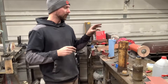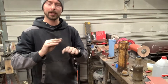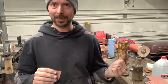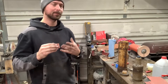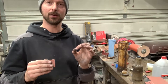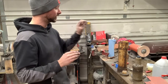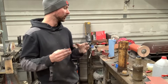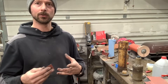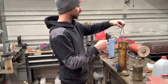It's been in for about 10 minutes — I'm going to pull it out and show you what it looks like. Then I'm going to do a really light polish with 1,200 grit sandpaper over the whole blade, do a quick rinse with distilled water, and then it goes back in the etch for another 10 minutes. What this does is polish and show those layers better. When you bring it up to 2,000 doing this and then do a coffee etch, compared to just etching at 800 and leaving it, the contrast is way, way better between those layers of steel. It takes more time but it's well worth it. Let's pull it out and show you what it's looking like.